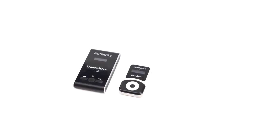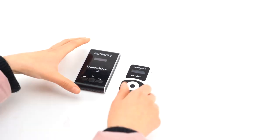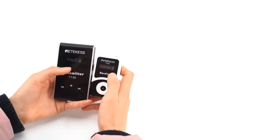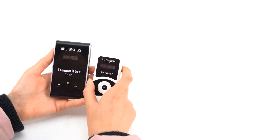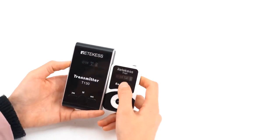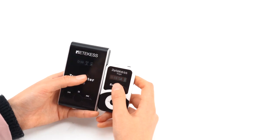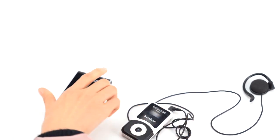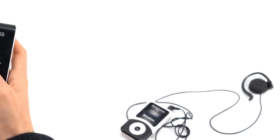The second point to note is to plug in the headset and mic. You can see that the transmitter and receiver are on the same channel, but as soon as the receiver moves away from the transmitter, the signal on the screen will weaken until it disappears. Only when the receiver is right next to the transmitter will the signal appear. Please note that this is not a product fault — you just need to plug in the headset and mic.